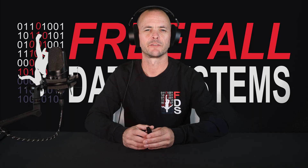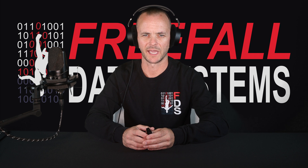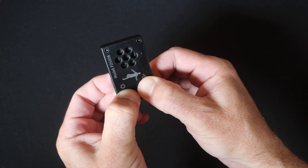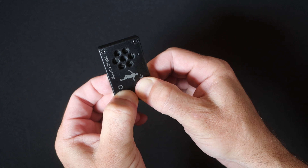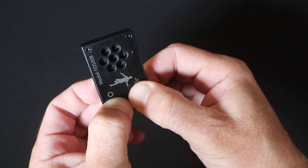Note, however, that this information is lost when the altimeter runs out of battery, is set with the web USB app, or the firmware is updated or shared. If you hold down the buttons past this, it will read off the current firmware number. If you keep holding it down further, you'll enter sleep mode. To wake up from sleep mode, simply press the settings button until you hear your desired setting.